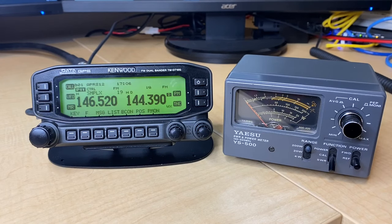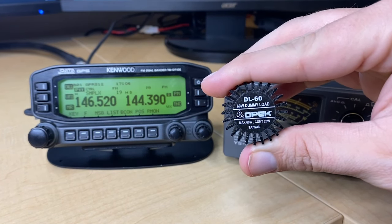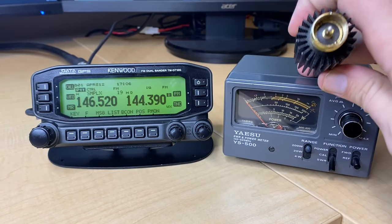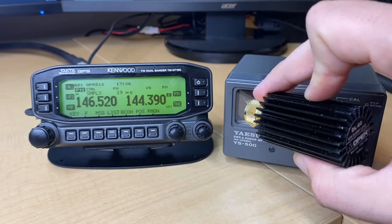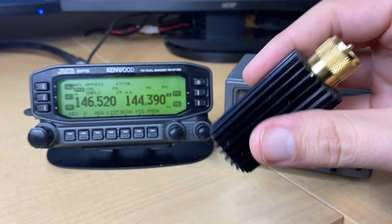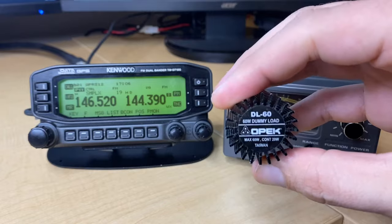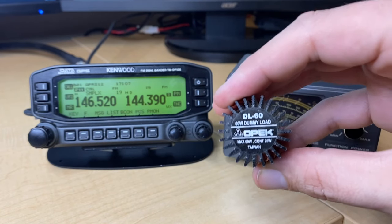Another helpful piece of equipment in your ham shack is what's known as a dummy load. This is an OPEK DL60 60-watt dummy load. A dummy load in the most basic sense simulates an antenna to your radio. If I plug this dummy load into the back of this SWR meter, I'm doing it purely for power testing — I really want to test the true output power of my radio. The radio thinks it's transmitting to a perfectly matched antenna, but all that RF power gets dissipated across this heat sink, and you'll feel it get hot as you transmit. This simulates the perfect antenna to trick your radio so you can do accurate power testing. I'll put a link in the description where you can buy this dummy load.